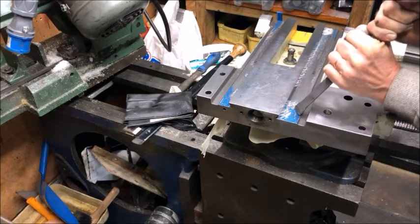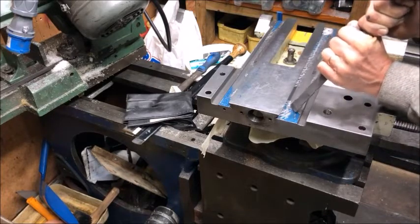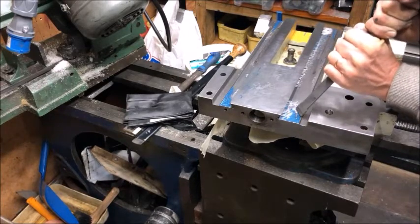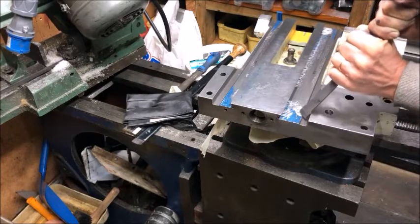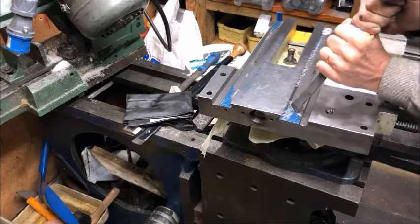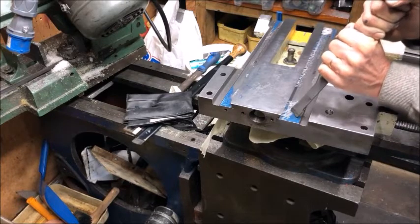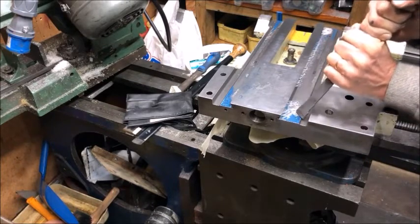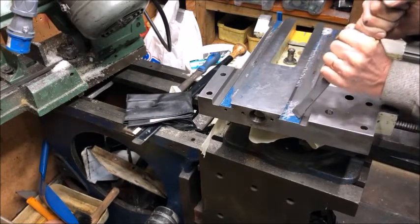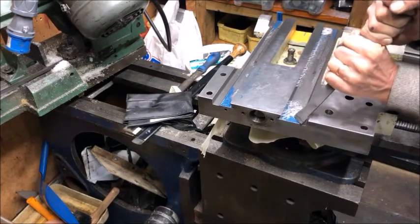And then we get the chance to train or practice with the pull scraping method, with the blade ground a little bit different — the angles are different. As you can see, I use quite a lot of force, but still the efficiency of each stroke and the speed is quite low. This is only done so because there was no room, due to the protrusion on each side, to get down into that pocket sufficiently with push scraping. So this is an alternative technique that comes in handy sometimes, if not always.